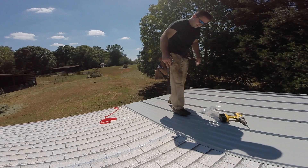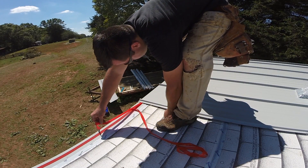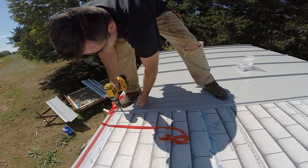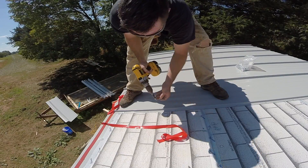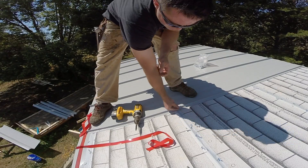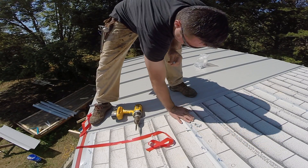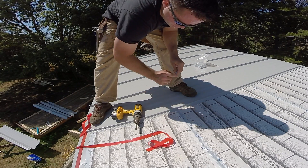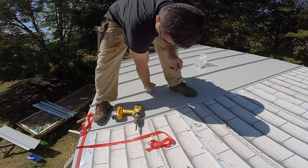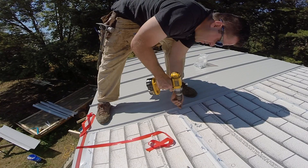You could use a rubber mallet to do this but I found that this works fine too. You can hear it click in. Now if I lightly pull up on this piece, I can pull this strip out and stop it right there. When you're putting the screws in, you want to put one screw in every single one of these little cutouts they've made, and you want to make sure the screw goes perfectly straight. If the screw goes in on an angle, it won't sit down flat and will stick up. Then when you put the next panel on and press it down, the head of the screw is going to bend the metal up — so make sure they go in perfectly square to the roof.